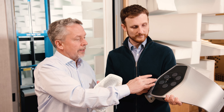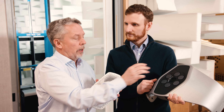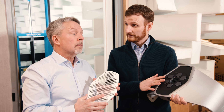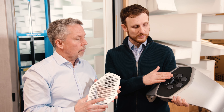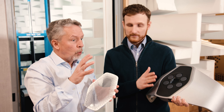That's fascinating. Now what's also interesting about this design is it's kind of like a coaxial driver — the tweeter is right in the middle of the mid-range array. Do these mid-ranges interfere with the output of the tweeter? No, and that's one of the big benefits of it. Because we have a fixed waveguide for the tweeter and we have most of our baffle fixed, the tweeter doesn't see any movement from the front baffle.